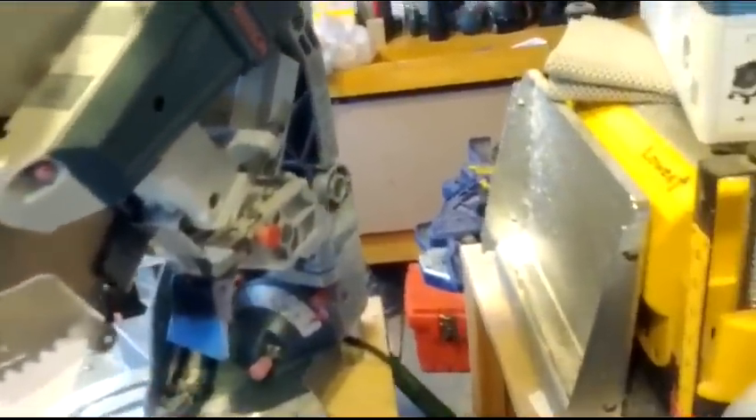We're going to take this Bosch saw with the glide mechanism that doesn't stick out in the back, and tuck it tight into this recess so that my miter saw bench, which is going to run here, projects out as little as possible from the wall. Tonight's activity is going to be to build an extension jamb like I have for this window, to frame out around this frame. I'll later fill in between the ISO and that frame and the sheathing, which is still on the floor. When it comes up to the frame, it'll close off that gap. So this is the before.